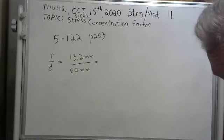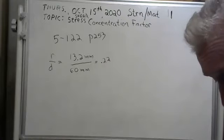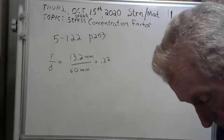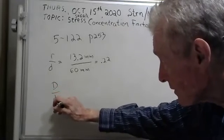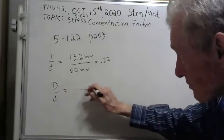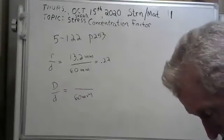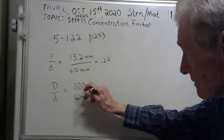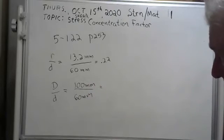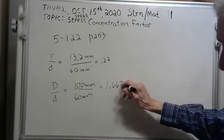13.2 divided by 60 is 0.22. Okay, now we also need the big D over little d. All right, well, we can do that. Thanks to Alex, we know little d is 60 millimeters. But what's the big D? Well, it looks like 100 millimeters. Okay, 100 divided by 60, I get 1.66, a whole bunch of sixes.